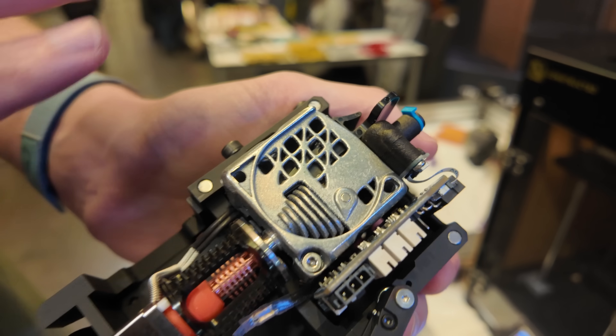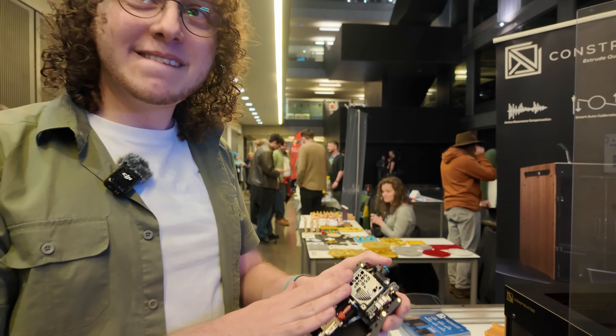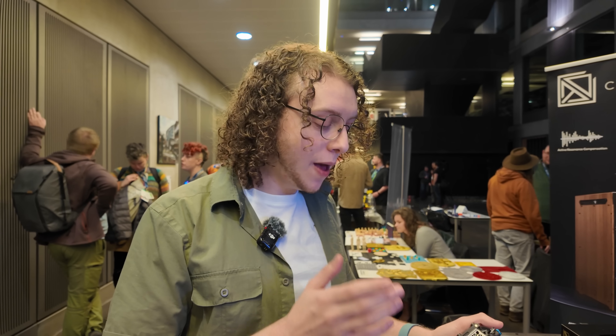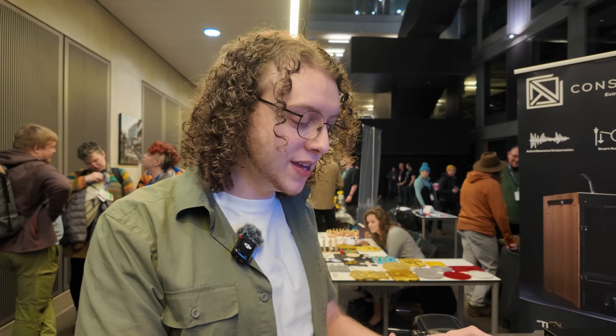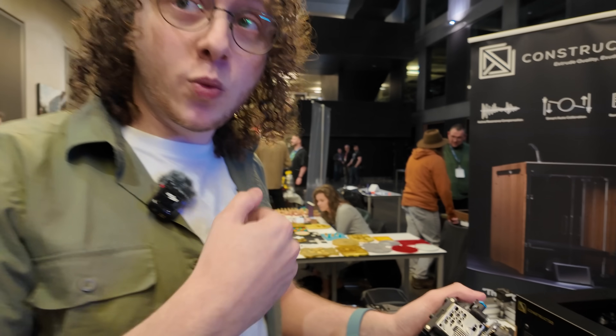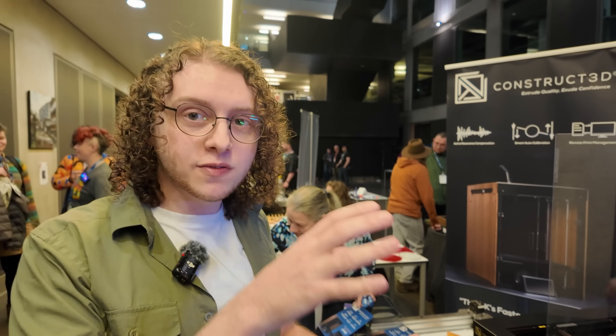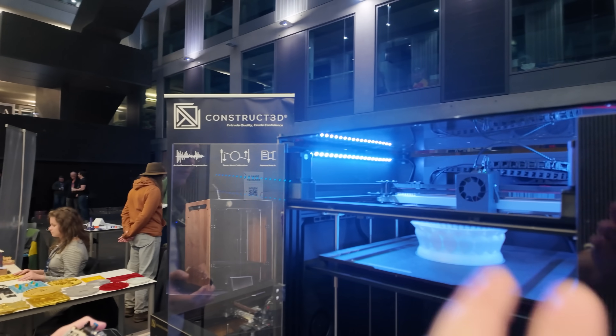The Duet tool board is standard, with a possible future custom shroud. We're likely sticking with the aluminium version of the extruder because E3D's quality control is excellent — they machine the internal gears better than we could. At the cost of this machine, the 50 quid extra for that perfect meshed gear experience is a drop in the bucket and gives a nice reliability boost.